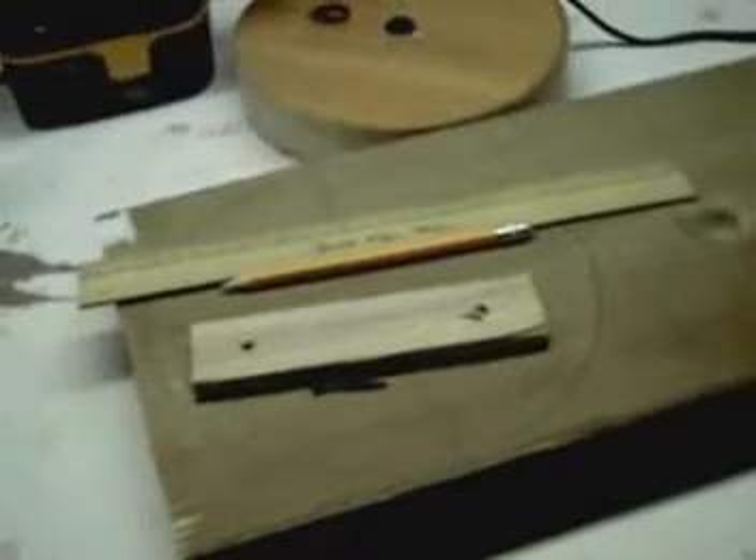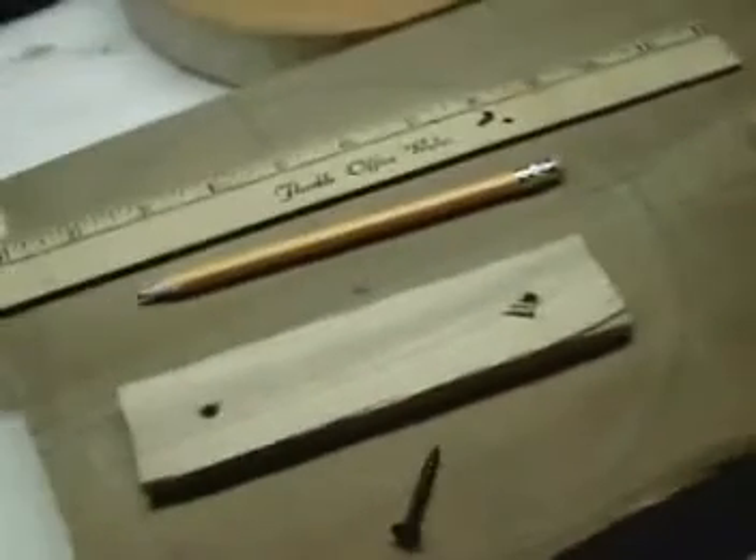As you can see, I have my wheel drawn now, so I just need to cut it out. Pretty simple. Carrying on a bit further from my four-inch jig, I decided I could have used the ruler and drilled holes in it, but I didn't have the exact center and wanted everything squared up. I still need one of these, but I want something that looks a little nicer. So I went to Hobby Lobby — it's a big hobby store — and got a grid ruler. It's plastic, cheap, like two or three bucks. I'm going to drill a hole at every inch right down the center, since the lines are already marked perfectly, and then I'll have a nice large jig compass.